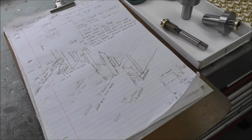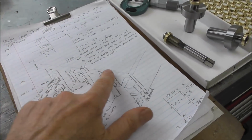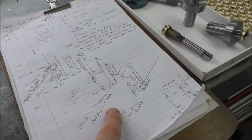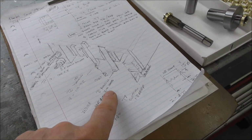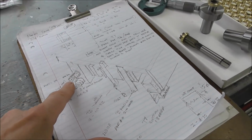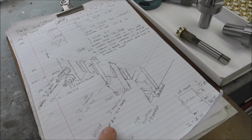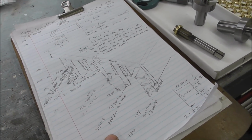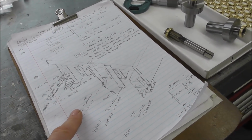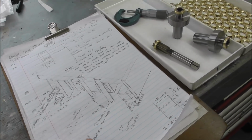With the gang tooling layout, I've found it really helps to do a quick sketch showing the tools and making little notes on them with details of tool radius, tool type, projection length, tool numbers, and Y offset positions, and that type of thing, so that next time you come to do the job you can set it up much more quickly.